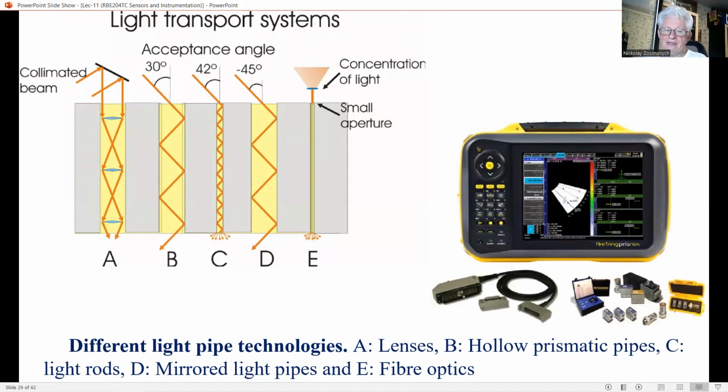The smaller the diameter, the more severe the requirements with respect to size, power efficiency, battery power, and cost. As an example of an optical test system for small pipe diameter, this work concerns an optical system that measures the inner surface of a 10 mm part. The sensing system consists of a laser, a scanning mirror, a motor, and a PSD assembled to fit inside the part. The system enables the detection of surface defects as small as 0.1 mm by means of triangulation.